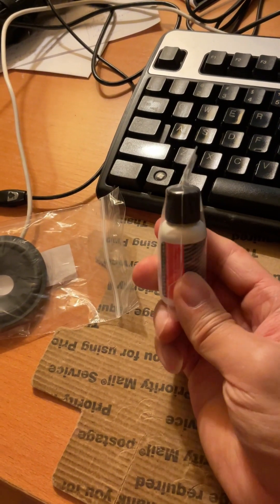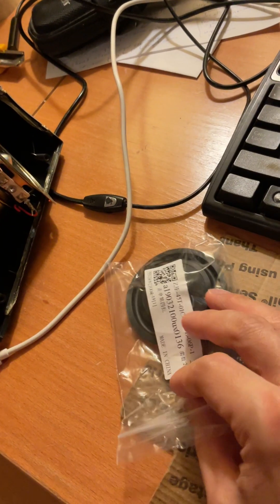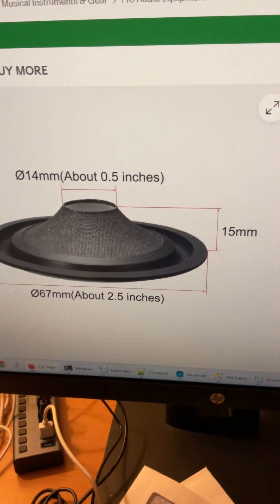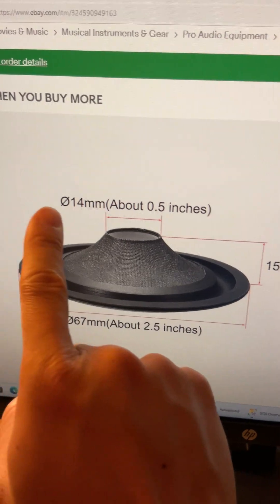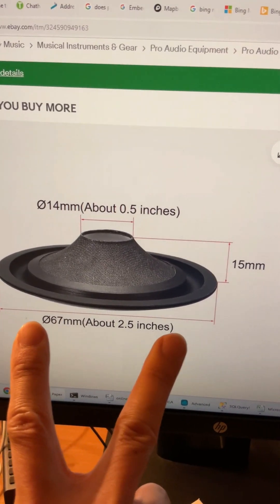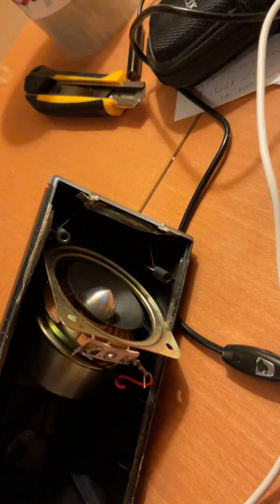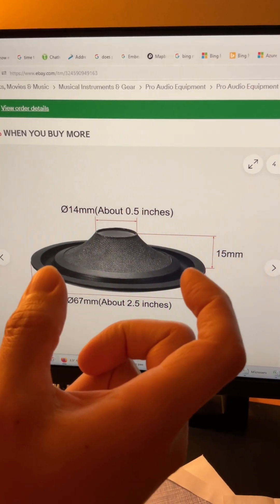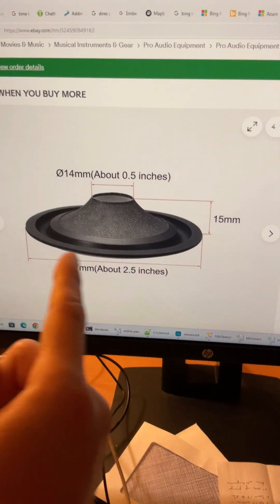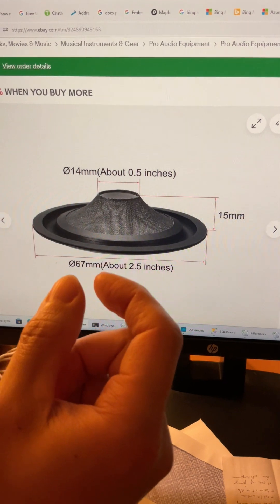Fast forward a couple of weeks, and we have our speaker glue. This is a half-ounce speaker glue, specifically elastic enough to handle replacing the rubber gasket, as well as our new rubber gaskets. I had to get these from China because they don't sell these in the US. What you're going to do is look online for the specific diameter of your speaker. These millimeter markings matched up pretty much exactly. I just took a ruler and measured across the cone of the speaker — this 67 millimeter marking was almost exactly what I needed.